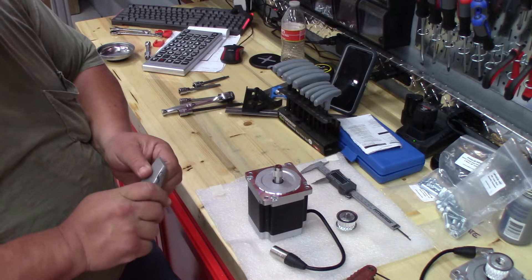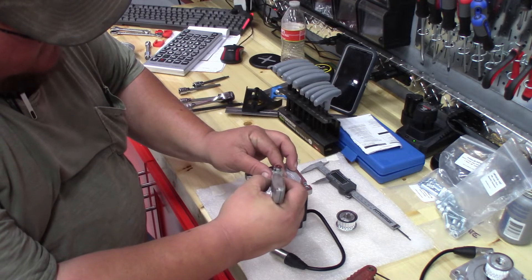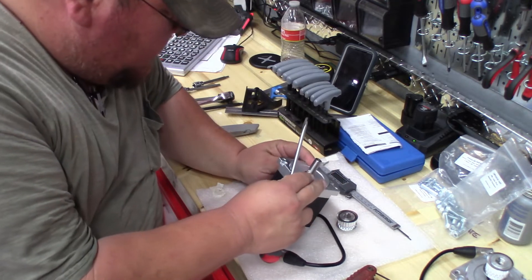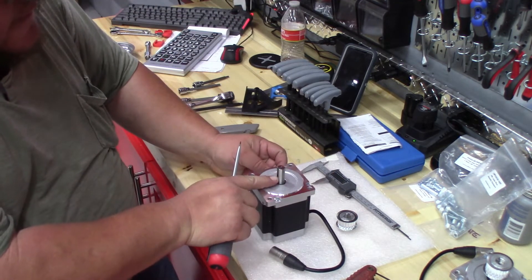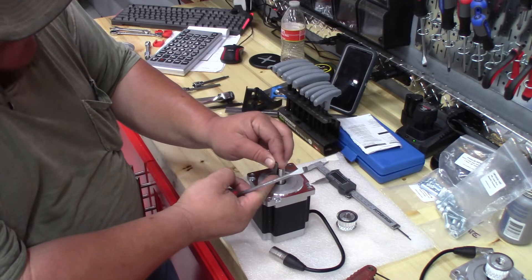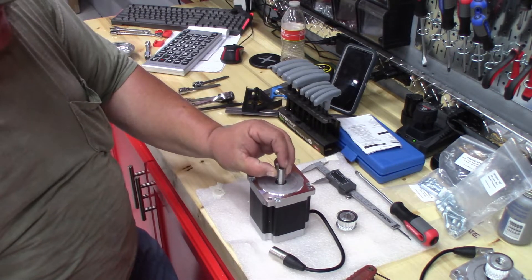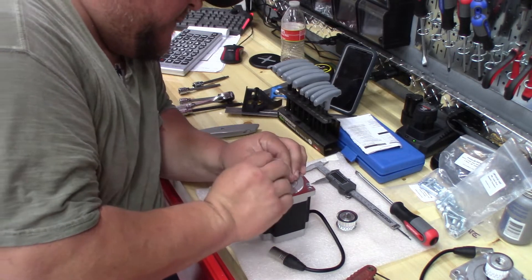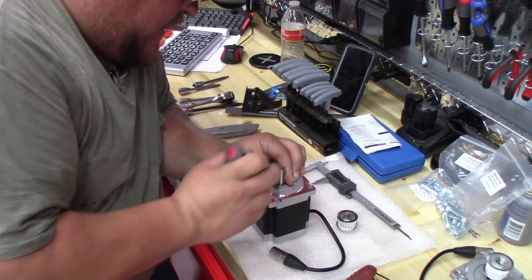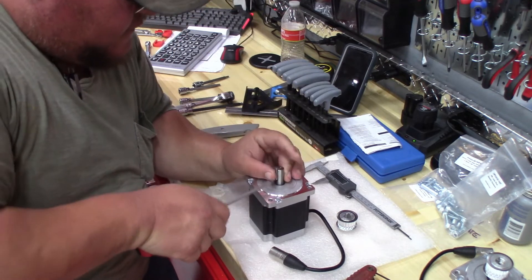You can just get a knife or box blade and get this tape off of here. If we take this keyway out and look at it, it looks like it's pretty flat. Sometimes on the keyway they'll taper up toward the end, and what that'll do is, if it's pushed all the way in, it'll kick this out and kind of jams it — doesn't allow you to get that pulley fully seated down where you need it to go. Just stuff I've learned working on tractors and similar equipment.